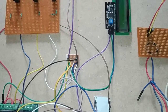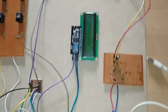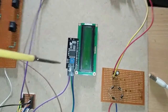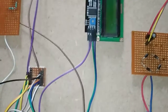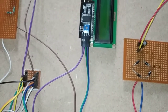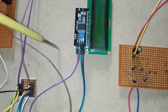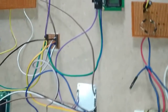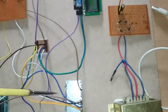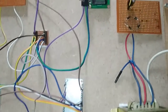Next I will show how the 16x2 LCD I2C module is connected to the NodeMCU. It has four pins: VCC, GND, SCL (Serial Clock), and SDA (Serial Data). VCC and GND are connected to the power junction. The SCL pin is connected to pin D22 and the SDA pin is connected to pin D21 of the NodeMCU 32. This is an I2C interface LCD module.